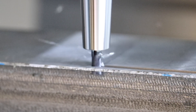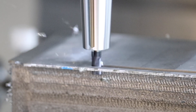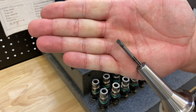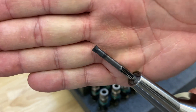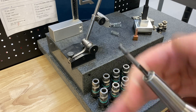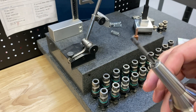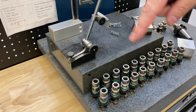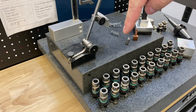Anyway, I just wanted to show you this was the solution. We tried the EDM — I'm very fortunate to have that machine for making molds — but at the end of the day a super small diameter high-feed end mill was the answer. For the record, I think we were running about 300 surface feet, about four and a half thousandths depth of cut, full width of cut, and about four and a half to five thousandths feed per tooth. One of the tricks is that I used a boring operation — a 2D bore inside Fusion 360.